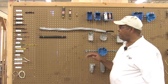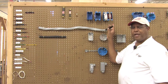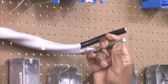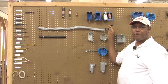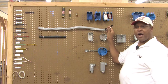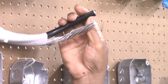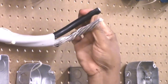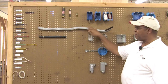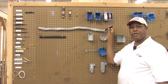I'm going to start over here with the service entrance cable. This particular piece of cable is quite big and it has three conductors. It has a bare copper, and this one for this example is aluminum. Aluminum is much cheaper than copper when it comes to service entrance cable. We have this 4/0 aluminum for 200-amp service, and we have two hot legs to take care of the 240 volts — one here and the other you can't see, which is down behind the cable — but they're all encased in this enclosure right here.